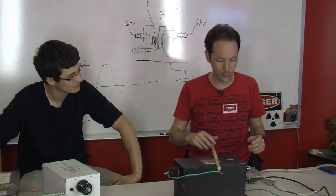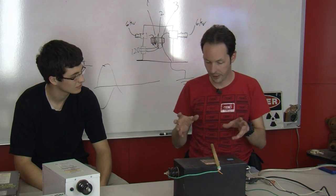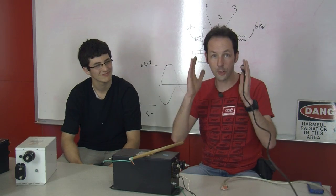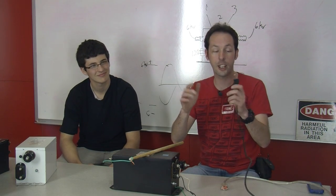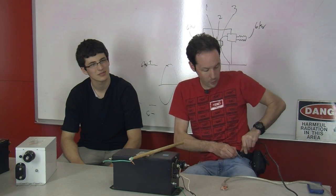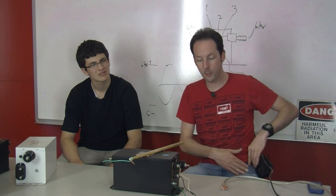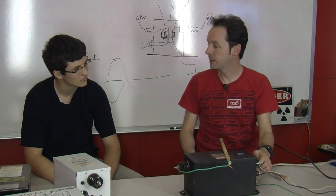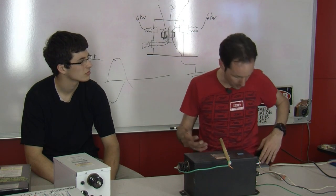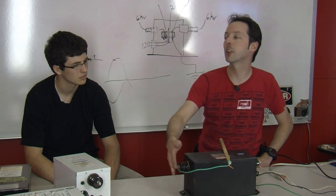And you will learn. The first thing that you learn when working with this stuff is if you're going to reach out and touch the transformer, the electrical components, unplug it. And watch this, this is your huge high-tech safety lesson, okay? Unplug the transformer. Put the plug in your pocket. If you always put the plug in your pocket, there's no way this can hurt you. And whenever possible, you can't always, but try, put your hand in your pocket too. One hand. Because if you get bit like this, it hurts really, really bad.